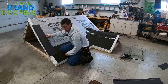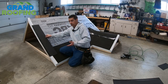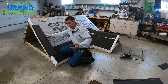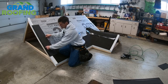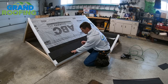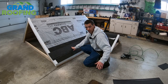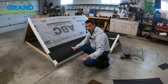For your starter on the gable end, check with your manufacturer — some say hang it over a half inch. Whatever shingle brand you're using, look up your manufacturer. Also, if you're in a high wind region, look up your area. You're going to want to hang it over your starter on your gable with the seal strip up and out. You also want to make sure your starter is offset from your first shingle — never get within five inches or less. This manufacturer actually says three and a half, which is way too close in my opinion. The lower the slope, you want your staggers off a little bit further.